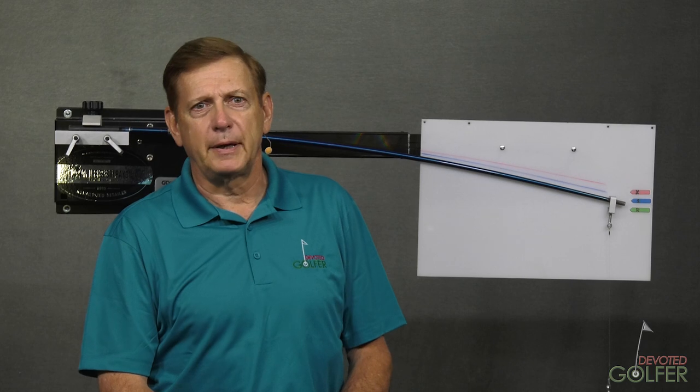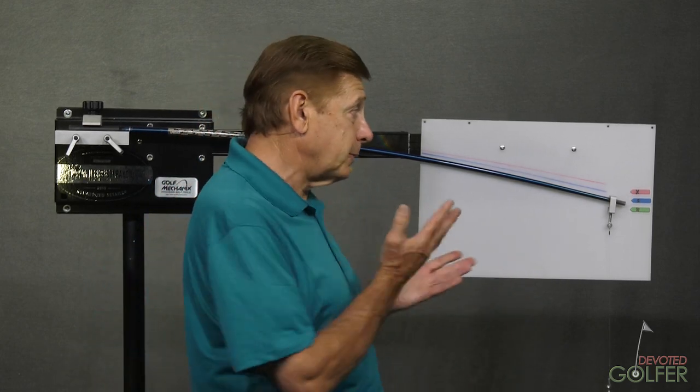As you've seen, the shaft is clamped at the handle, the weight is put on the tip, and the shaft bends. The amount of bend is read from the chart behind the shaft and a number is assigned to a stiffness — or more commonly a letter: L, A, R, S, or X. What one decides each of these letters means is arbitrary, and there was no way to automate this process. But a few years ago, advances in cameras made it possible to image the shaft while deflecting it and analyze the image. That image is not much different than the deflection board used by Hogan's Clubmaker many years ago. Deflection boards remain a low-cost way to rate overall shaft stiffness.